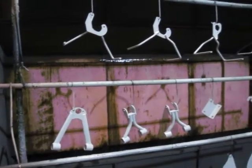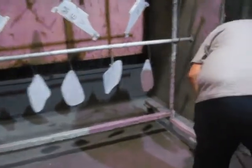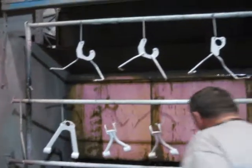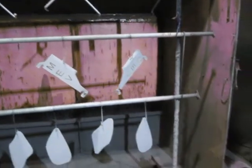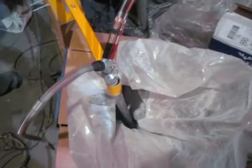Here's one we did earlier — they've had one coat of zinc primer already, been in the oven partly cured. Wire going back on, electrically charged now. Another coat of powder and then back in the oven. Back out the oven with a top coat. Here's a little unit, here's a box of powder — powder's been sucked up and blown out all over these components.